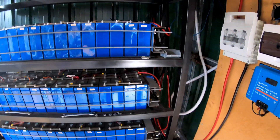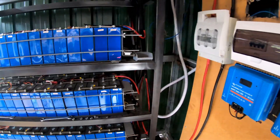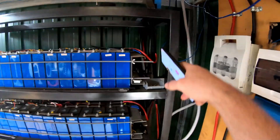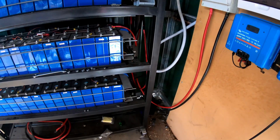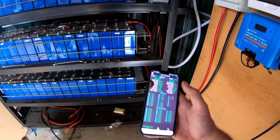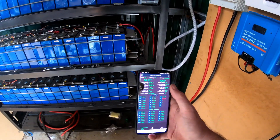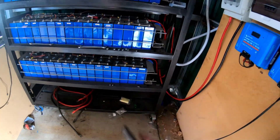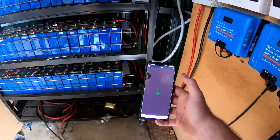What I actually came out here to check wasn't the chargers so much. We've got these three shelves all attached to this Lynx system here, and what that means is there are different-sized cables. As much as I tried to keep them roughly the same length by adding a little bit of extra meat here, here, and here, what it generally means is that the top shelves actually get more power into them than the bottom shelf.